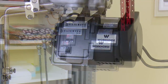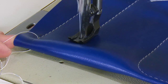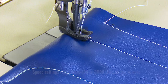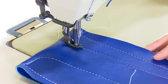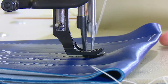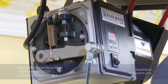The Workhorse is a 550-watt, 3/4-horsepower servo motor designed for continuous use on industrial sewing machines. Speed setting ranges from 400 to 3,600 stitches per minute. Now you have the torque and power to punch through thick assemblies, and yet you have the super slow speed control so that you can stitch one stitch at a time without the machine taking off on you as it would with the clutch motor. The Sailrite Workhorse Servo Motor — available only from Sailrite.